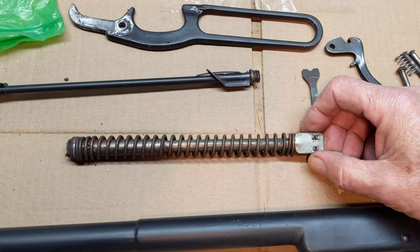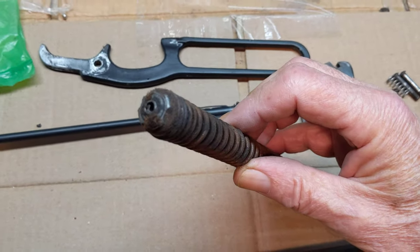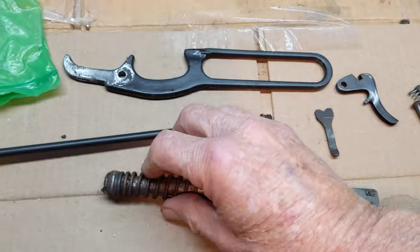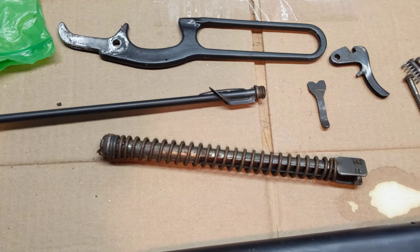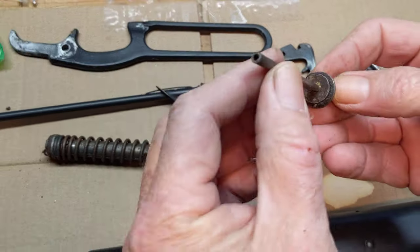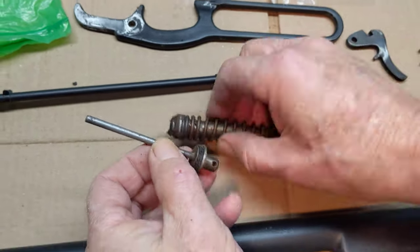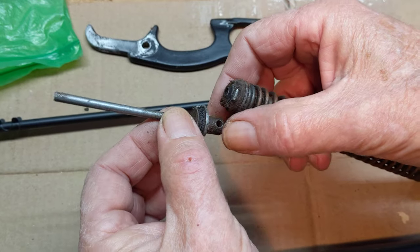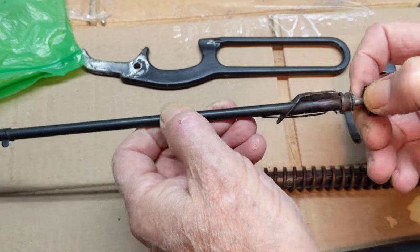Can you guess? I guess something's wrong with the spring. There's no leather piece — well, there is some leftover leather piece here — but the main thing is there is no air tube. That's the problem. It's called the Top Hat. When we take this apart in just a second, you'll see the similarities, except the fact that the one in this gun no longer has the air tube. So it's incapable of transferring air from the compression chamber to the base of the BB in the shot tube and pushing it down the barrel. That is the major flaw in the gun.